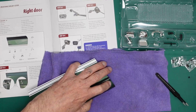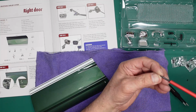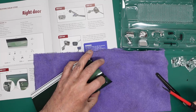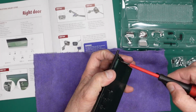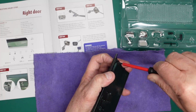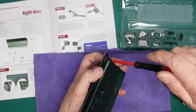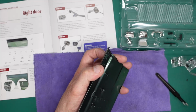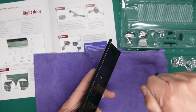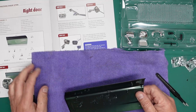We're going to grab a PS12 screw. So obviously the P is for plastic. I'm going to stick that on the screwdriver. I'm going to pick this up. And we're going to plonk that in that hole. And then we're just going to turn the screw until it stops. Not try and graunch it up or anything. Just turn the screw until it stops. It doesn't really matter if that's moving around a touch even. Just don't go graunching it, stripping the thread, splitting the plastic, whatever. Okay, so we've done that part.